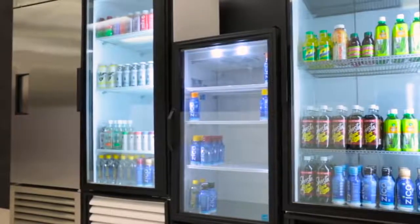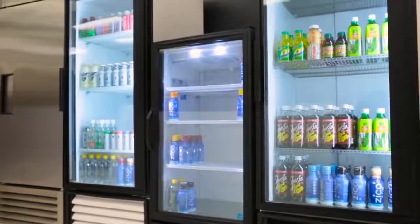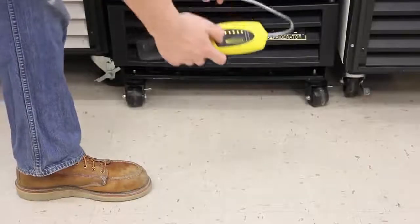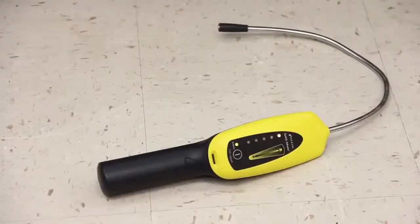The repair we are going to show is replacing a condensing unit on an R290 system that was previously diagnosed with a locked-up compressor. Our R290 repair starts with the service technician turning on his combustible gas leak detector and leaving it on throughout the entire repair. When you turn on the combustible gas leak detector, it will have to self-calibrate. This will take about a minute. Once the high-pitched beeping levels off, you can continue. Do not proceed with the repair until the meter levels off.